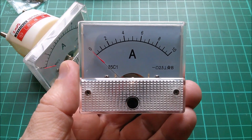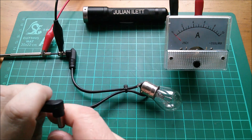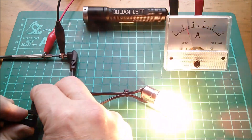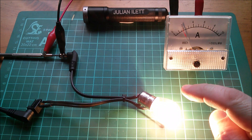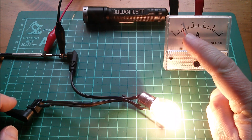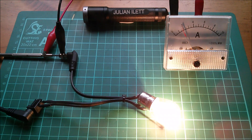I thought I'd hook this up into a circuit and check the amps. Right - 12 volts from my solar power system, actually 14.5 at the moment, the sun must have come out. A 21-watt 12-volt brake light bulb - let's see how many amps that draws. Just under two amps. Now the voltage is back to 13 volts, so two times 13 is 26 - this is a 21-watt bulb, so a bit less than two amps. It kind of works.